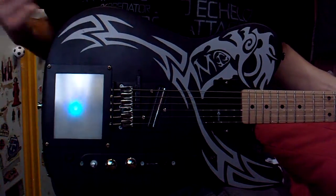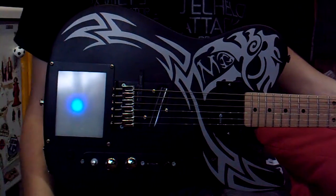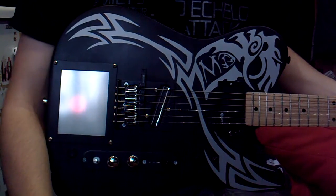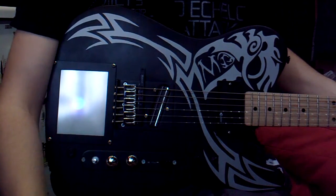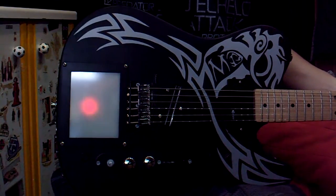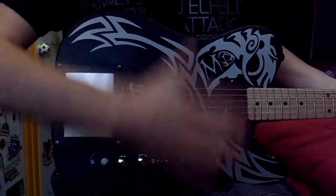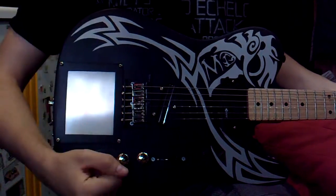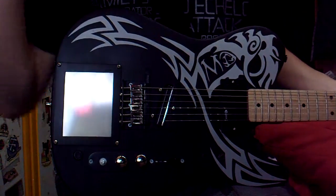So yeah, custom paint job. I designed it on Photoshop, and how I implemented it was I got from Staples some sticky labels, A4 sheet. I've got about 100 sheets in a box, and I printed my design off the computer onto them, sprayed the black on, put the sticky labels on with the design cut out, sprayed the chrome on, and took them off, and sprayed the lacquer over the top. Yeah, so it's looking really good. It's turned out quite well.